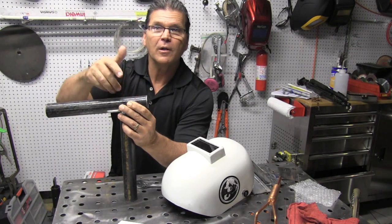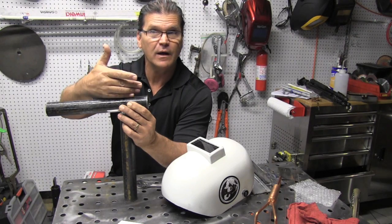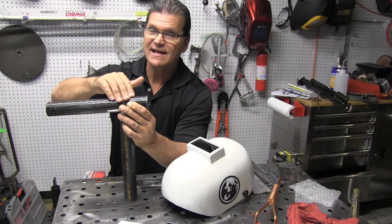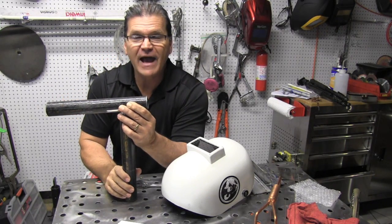We're going to talk a little bit about welding thick to thin. And we're going to weld both sides of those tabs. When you weld one side of something thin like that — a fillet weld — and then you heat up the other side where it oxidizes, that second side is not going to weld good. So what do you do to prevent that? These are topics we're going to tackle today.